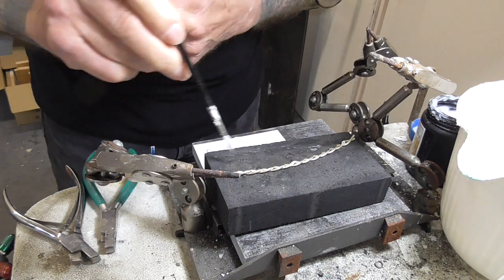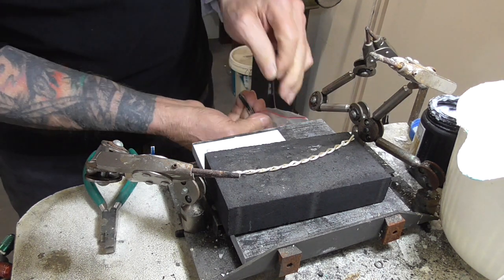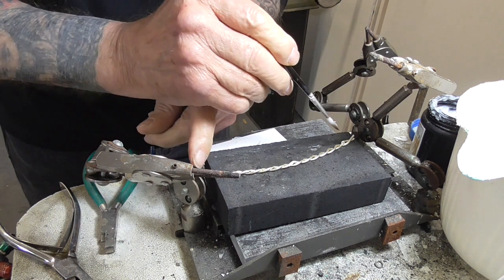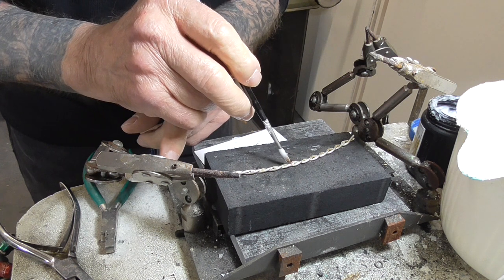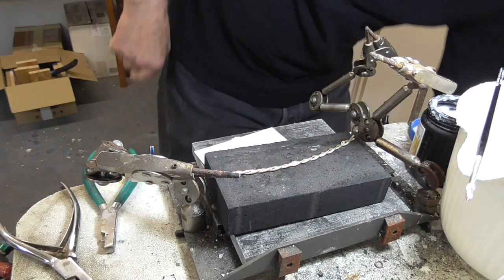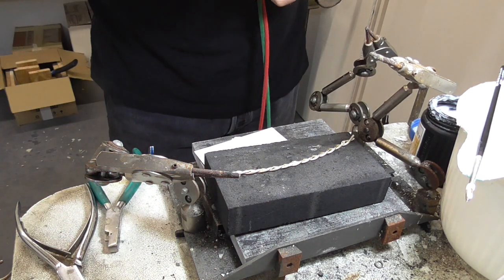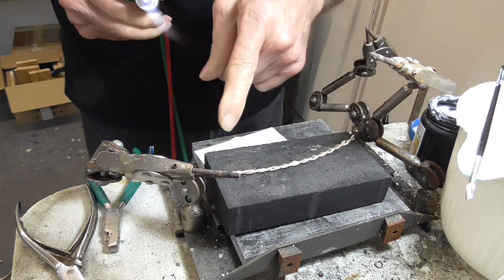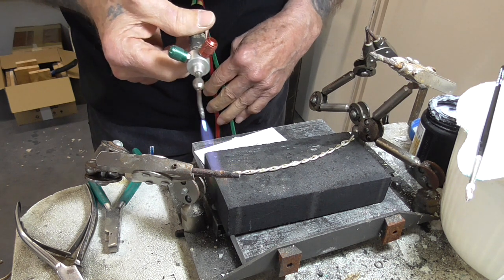So there, and there. Hard solder, 3mm long pieces placed with a flux brush. Neutral flame. Although, if all you have is a LPG air, it'll work quite well for this. So dry out the flux and then heat the metal until the solder flows.